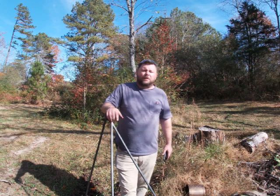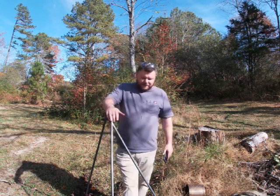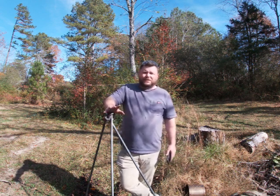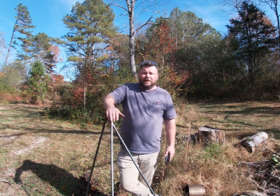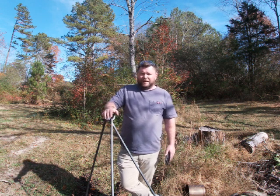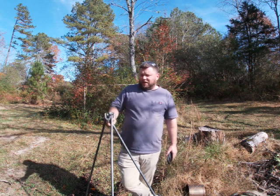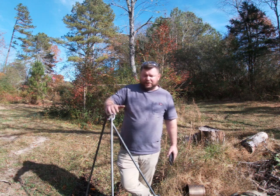All right, guys, so let's get real for a minute and talk about what we learned today. Well, we made our tripod spit, and this is a lot easier project than what it lets on to be. I used to be intimidated by these a lot until I've made them, and they're really not hard to make. It really is three or four steps. You make your points, make your blunt points, you make your eye, you make your two bends with your hooks on them, and you're done.